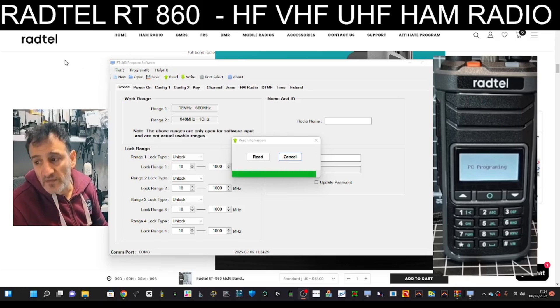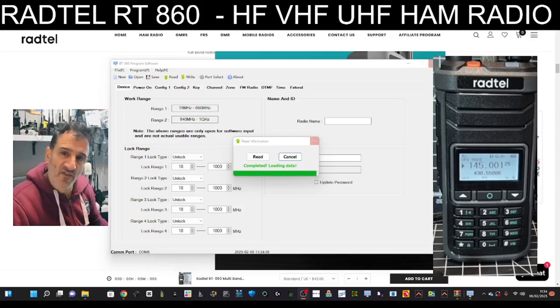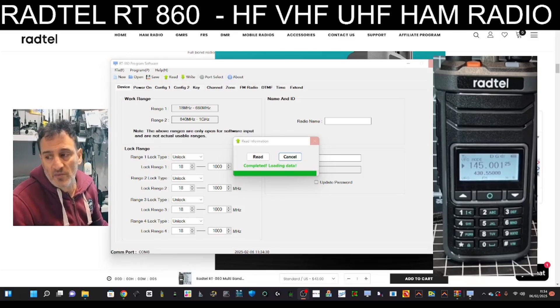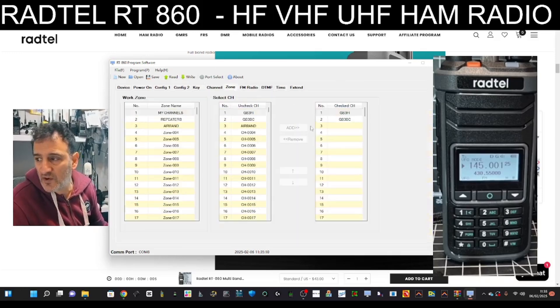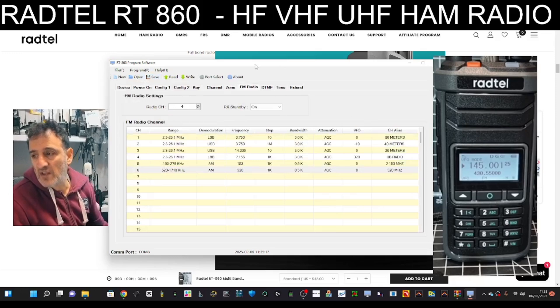It's quite advanced software. The DMR radio Radtel RT4D has a very similar version - same screen but with zones, contacts, color codes, and time slots - that's the DMR way of doing it. Once the read is done, you can add normal channels in the big channel window. You click the receive and transmit frequency, set your CTCSS on transmit, set power and name - literally that simple. You can also put it into zones, but that's a whole new topic for another video.